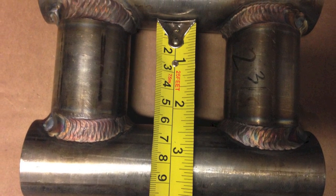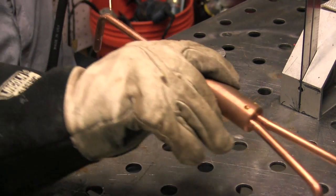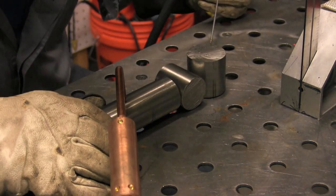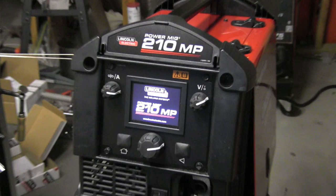I'm using an inch-and-a-half round stock — this is stainless, not sure what grade. It was in the scrap pile. Generally, bend test fixtures will be made out of hardened steel; the rollers will be made out of hardened steel. These aren't rollers — they're just the right radius, and I'll grease them up a little bit if I have any trouble. I'm not going to bend hundreds or thousands of straps, but it'll last me a pretty good long while.